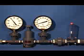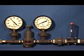As the system demands flow, you will see that the downstream pressure drops from the set pressure dramatically. As you can see, we have a deviation from the initial set pressure of 30 PSI. At 4 GPM the pressure drops to below 7 PSI. That's because this pressure regulator isn't opening enough, or its internal flow passages are so small they become restrictions. With a 20-plus PSI pressure drop, the competitor's valve is creating more trouble than it's worth.